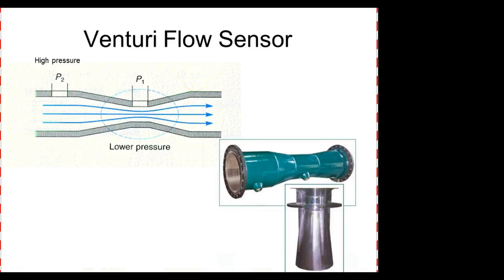Venturi type. This works on almost exactly the same principle. Venturi means we just have a narrowing, and then it comes up and re-expands. This is exactly the way our vacuum generators over on the Amatrol line and on the Festo line that create the suction cup work. It uses a Venturi. When we move flow through this smaller surface, it creates low pressure.